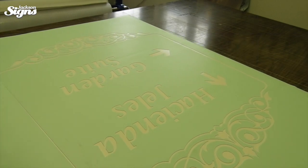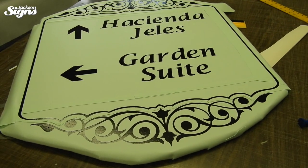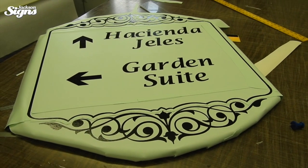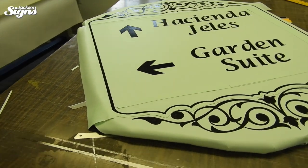Matt Jackson here, Jackson Signs, creating a sandblasted or hand-carved sign. What we have here is called a blast stencil. We're going to shoot sand media at this once it's mounted to the sign face from the previous video. It'll remove material in the open areas and create a beveled or recessed edge, giving it a really nice effect — you really see those shadows when it's done. This will look like a hand-carved sign when finished, with very high accuracy. I've got the stencil made and applied, so now we're going to take this outside, sandblast it, and create the routered effect. Stay tuned for the next video.